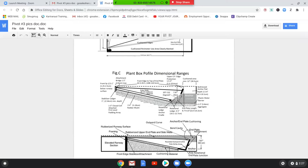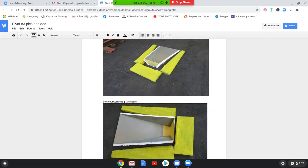The back end of the box, where the pole strikes with great force, needs a concrete anchor. There needs to be an attachment bridge on the front edge where it contacts the runway — it must attach to the subsurface of the runway, not the surface. That's why it needs to be at least three-quarters to one inch down. The next picture shows what it looks like as a profile in an elevated board runway.